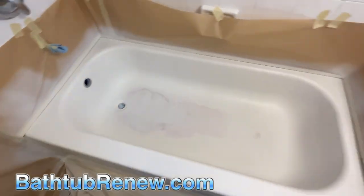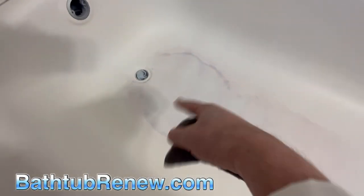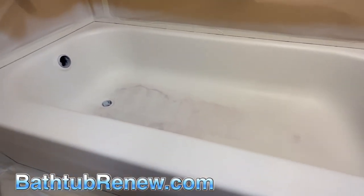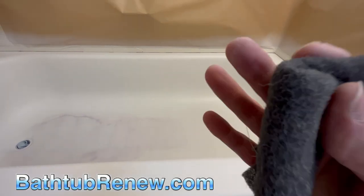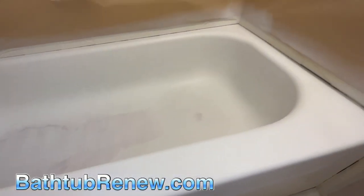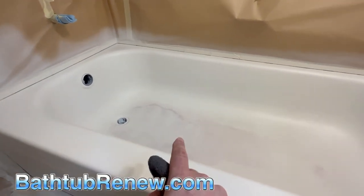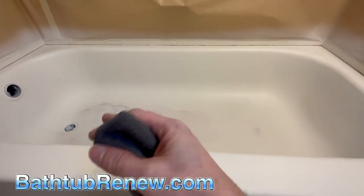She's all done with primer — three coats of primer. A little bit showed through but that's fine. Why do we prime? We want to seal it in and make a nice beautiful canvas to apply the coating on. It helps a little with color coverage, gives an added layer of protection, and increases bond to the porcelain. We waited 22 minutes after applying three coats: one coat, waited four to five minutes, second coat, four to five minutes, final third coat, then waited 22 minutes.